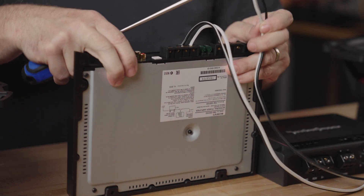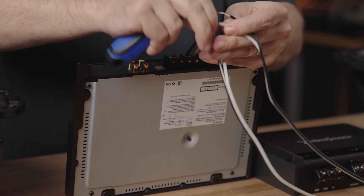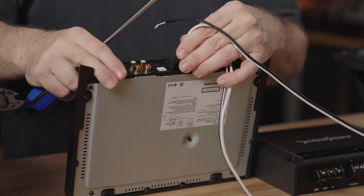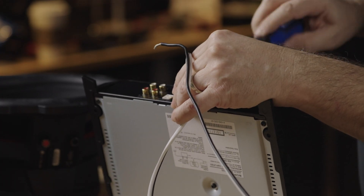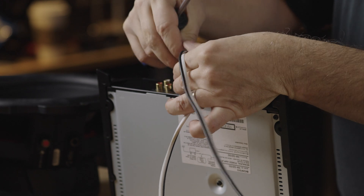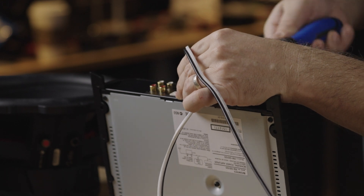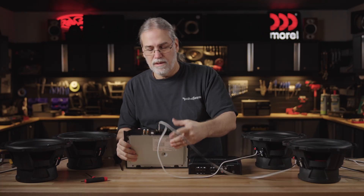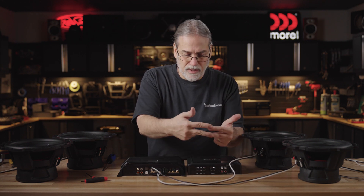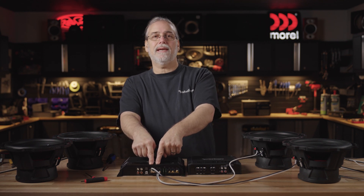There's the first one: match plus to plus, minus to minus, and we'll do the second one as well. So whereas before I actually twisted the wires to each other and put them in the one set of terminals, now I've got two sets of terminals. It makes it a little bit easier to get all the current out of the amplifier - we want all that power. It makes for a bigger pathway coming out. Snug you down. Unlike this one where I just joined the wires literally to each other, I've joined them onto the amplifier, so the amplifier itself is physically taking care of that parallel connection.